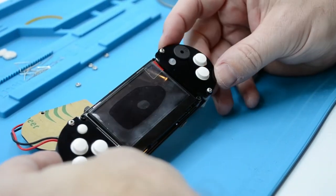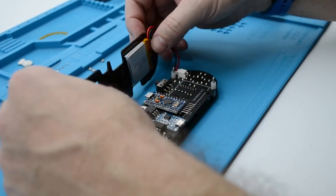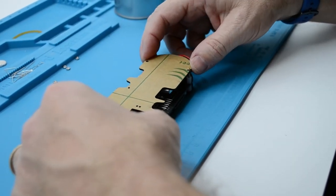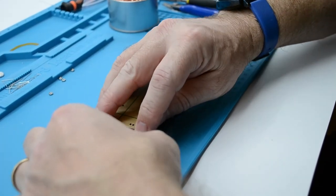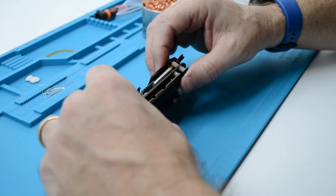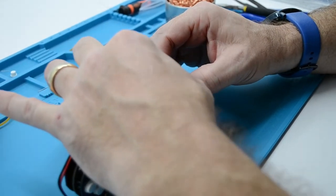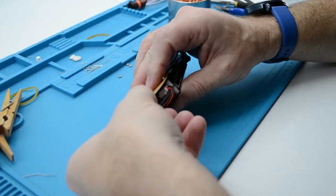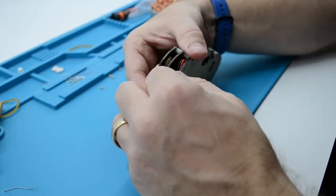Then place the back panel onto the PCB assembly by aligning it with the 4 holes. When aligning it, you should notice that one side of the back panel still has the brown paper on — this should be facing upwards. You should also notice there is a square cutout on the back panel; this should align with the memory chip. It's important when aligning it that the battery is plugged in and that the wires are pushed in with either your finger or tweezers. Do some wire management by twisting the wire and pushing it deeper into the casing assembly.